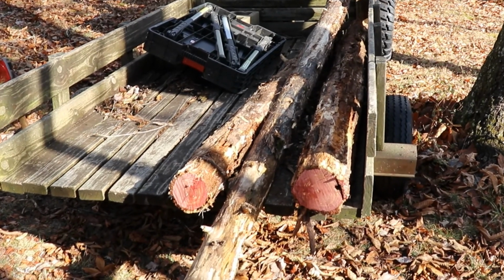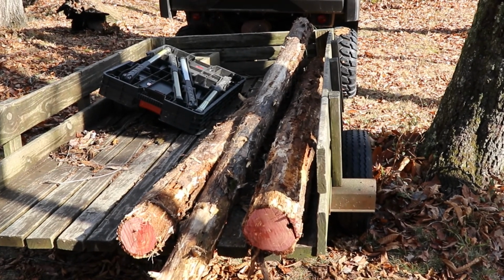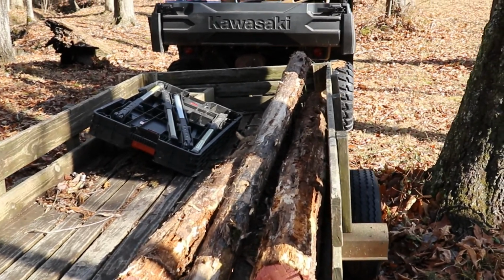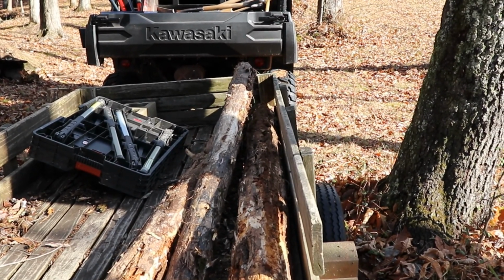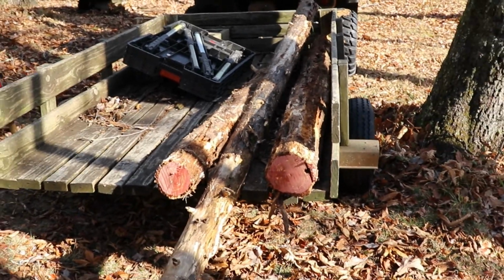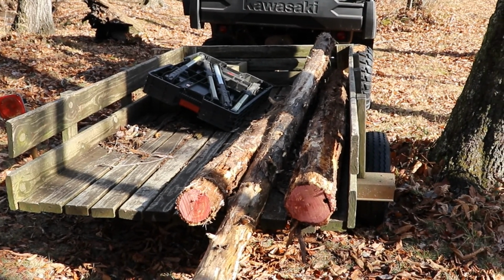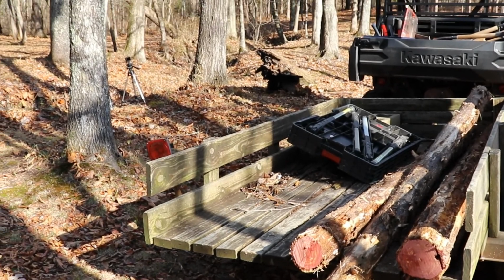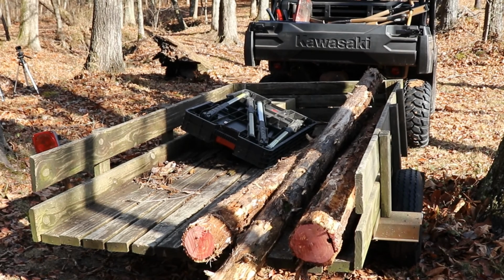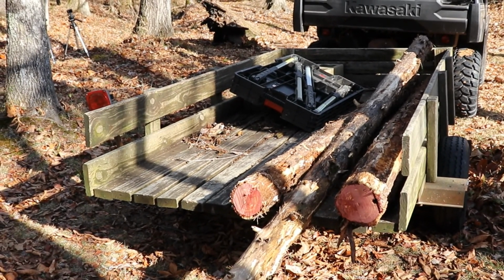This is the material we're going to be using, red cedar. And you can see, you always judge a cedar tree by how much red is in the tree. The rot that you see there is actually the bark that's just leaving the tree. The red in the center of the tree, or in this case all the way on the outer circumference of it, is what makes this wood durable. And it'll last a long time underneath the bridge. So it's good material to work with. And I am fortunate, I have several acres of cedar trees, so I don't have to waste anything.